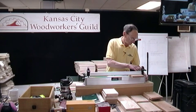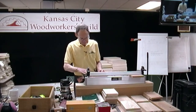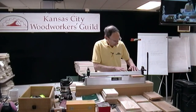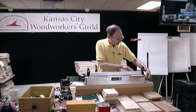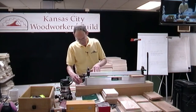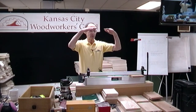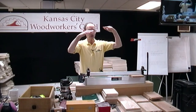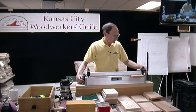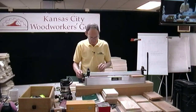Okay, so now I'm going to lower my finger assembly again. And oh, by the way, again, to keep things level, you know, always try to maintain that flatness and level situation. I'm kind of pressing down on these fingers as I snug up that knob, same thing over here, and I have a spacer board over here, see, so that my finger assembly doesn't go, oh shoot, you know, to avoid that gap that we talked about a minute ago. So I have this spacer board over here. Obviously critical would be to have it of the same thickness as your actual workpiece.